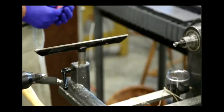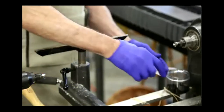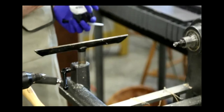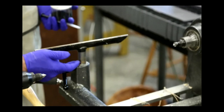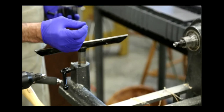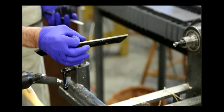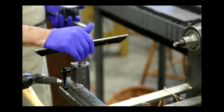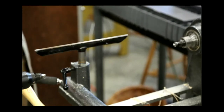I have not tried other than the shavings I'm working with. But again, a fairly effective patch can be made by adding the wood dust, but it needs to be dust that you find up around the bandsaw and places like that, and not chips or shavings. If you do chips or shavings and you fill a hole with it, it looks like it's got particle board in the patch. So the trick here is to have fine enough dust, if you will.